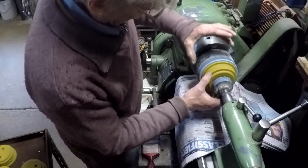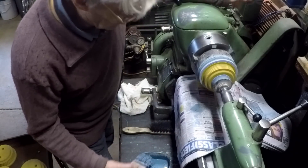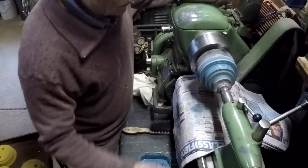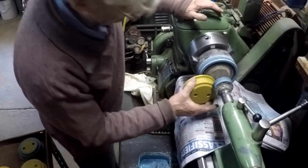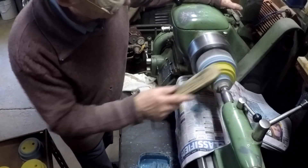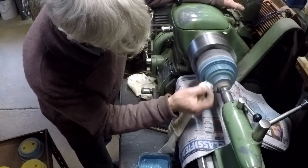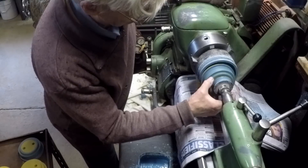This is the next stage in preparation of these shell cores. They get a coat of mold wash just to smooth up the threads. This is one of the advantages of shell cores — you can handle them like this. Most other methods of making cores produce cores nowhere near as strong. You couldn't treat them like this at all; they'd break and bits of rubbish would come off them. I don't like to have the wash up on this section, so I'm wiping it off, because it does cause problems in the casting later.